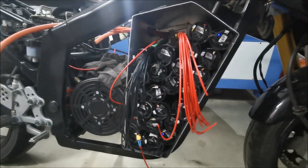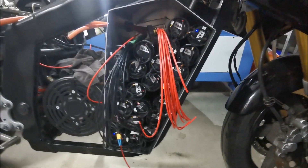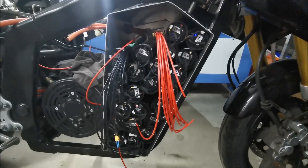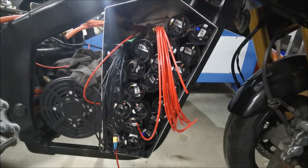The other thing I found out is that because I charged all these batteries at different times, they were all at slightly different voltages. I had some of them cutting out when connecting them to others. So I'm just going through charging them all up so they're all at roughly the same voltage, then I'll join them all up.